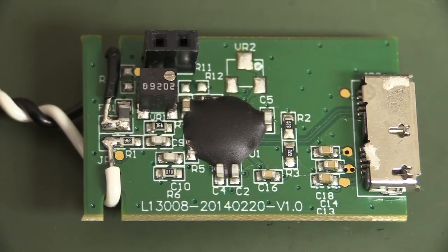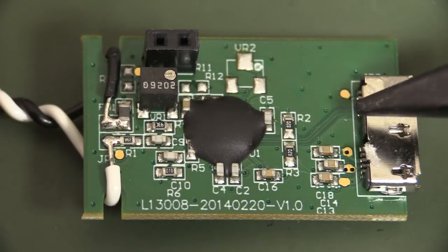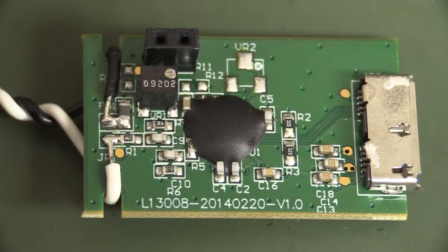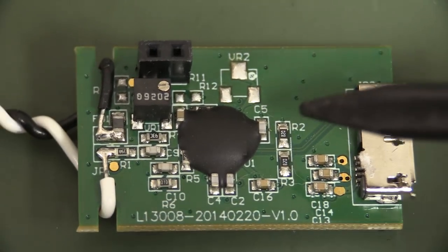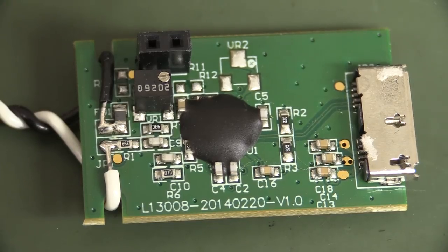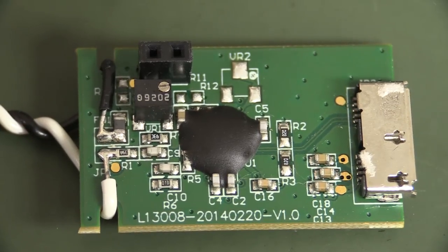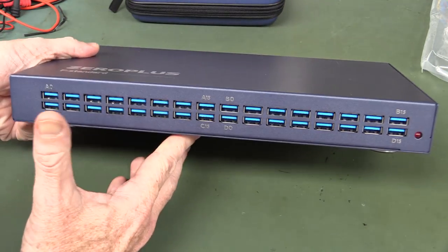Anyway, it's obviously got power, and you can see the differential pair. These are all individual channels, so the differential pair carries the data, and then they'd be using the power pins to power all that, the compensation trimmer resistor there, and that's about all she wrote. It's not a huge amount on there. Some decoupling on the bottom. Whether or not that's some sort of custom front-end solution, I don't know, because this one has a 1 gig sample rate, I think. This logic analyzer is serious business. But we won't ever know. Oh, boo-hoo.